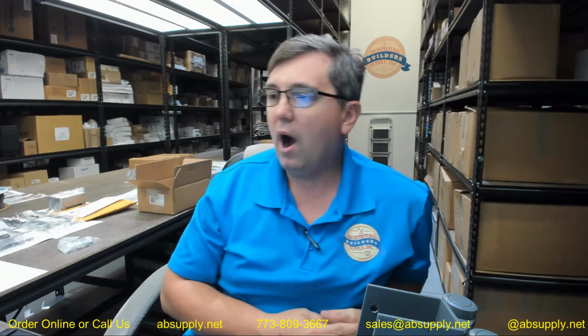So you're going to want to make sure you've got an ample margin. That's going to be a half of an inch. Depending on the height of the door, I might be cautious about really getting them ramped up and getting two doors moving towards each other. You don't want to have 400-pound doors crash into each other. So be mindful of that and absolutely follow the installation instructions.